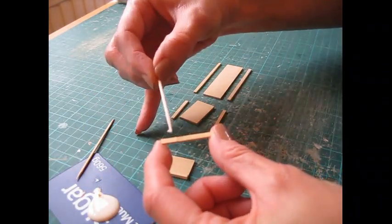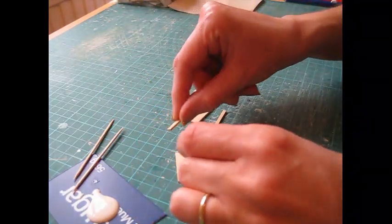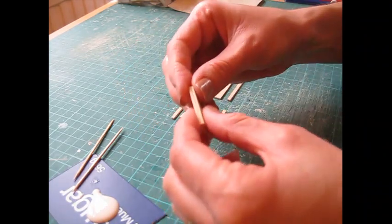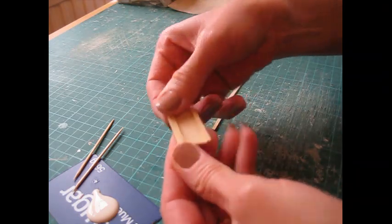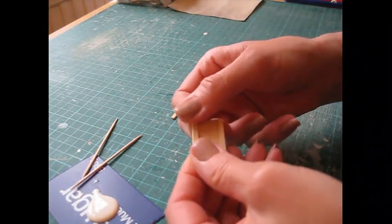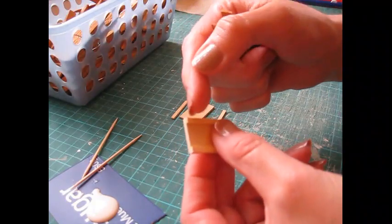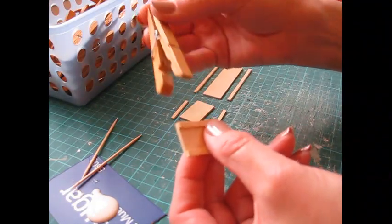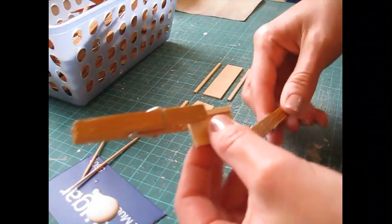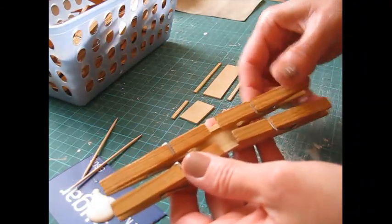For the remaining molding, apply glue to the side that has a small chunk out of one edge. Remove the excess glue. When applying moldings or pieces of wood to larger pieces you need to secure them together, otherwise when the glue dries the wood will just curl upwards. To do that I'm using pegs - clothes pegs - but you could use clamps. Then that piece can be put to one side to dry.